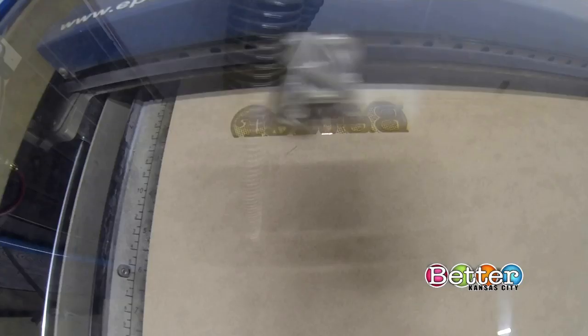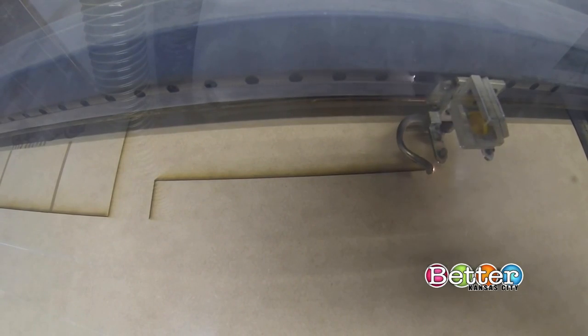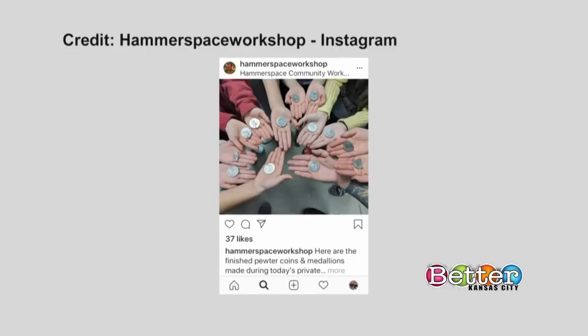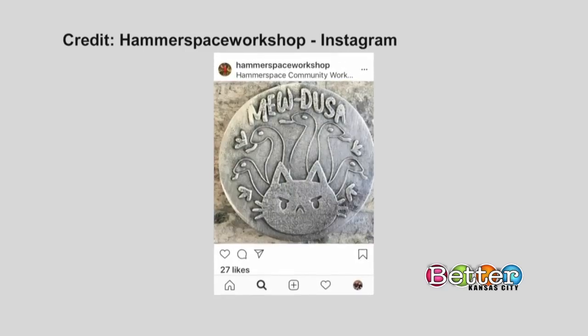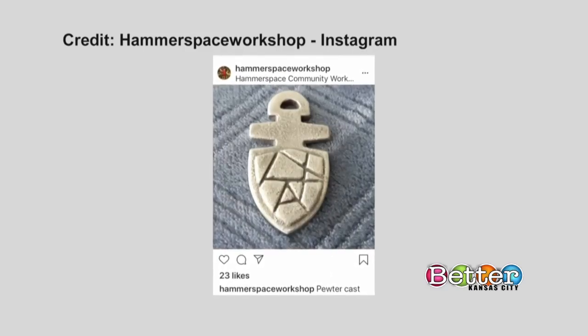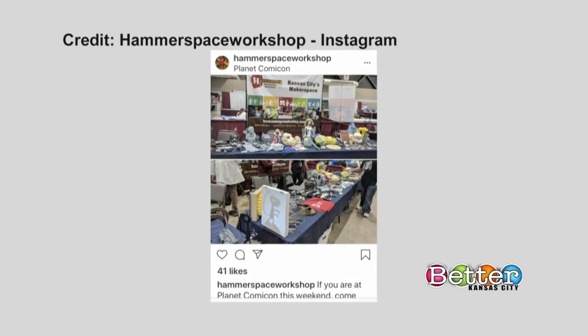In the laser process that's going on right now, how does that actually work? The art that we have on our screen acts as a template for our computer to follow, laying down a laser beam one row at a time or by following the outline of our part to cut out parts that you design using CAD software or drawing software like Illustrator or CorelDRAW. We use it for awards, for medallions for athletes, for challenge coins, for congratulations for employees or other events for organizations. And we use it for decorative pieces on costumes for Comic-Con — all sorts of little detailed metal work that we would ordinarily do with a much more expensive, more involved process.